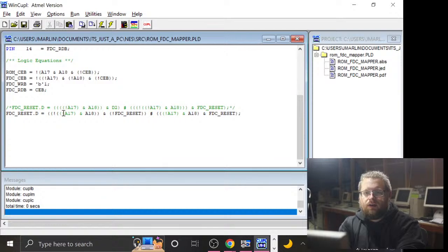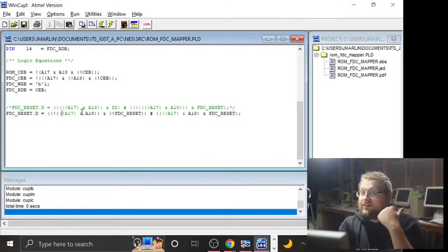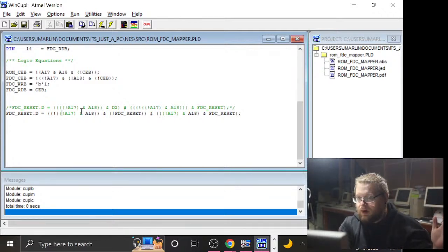Right. All right, so in the code that we have on the GAL, this is configured for... Because here's the thing, C000 is in the NES's address space, but basically there is a bigger address space on the other side of the MMC3, and the MMC3 allows you to map windows of this big memory area, which can include big chunks of EEPROM that are even bigger than the available memory space in a Nintendo, to smaller windows in the actual 16-bit address space of the 6502. So that's what we have.